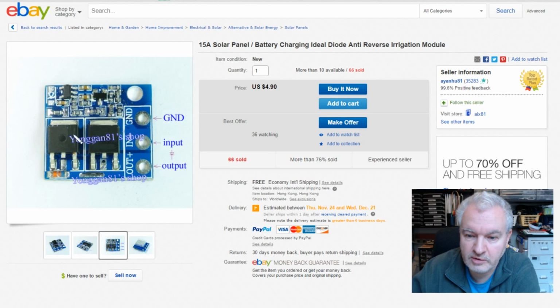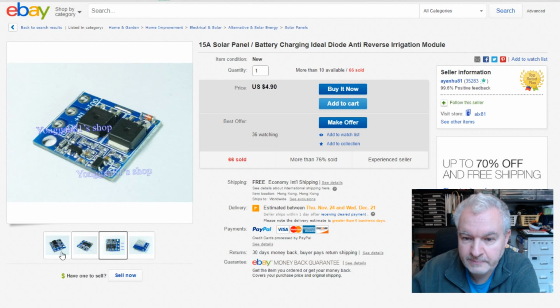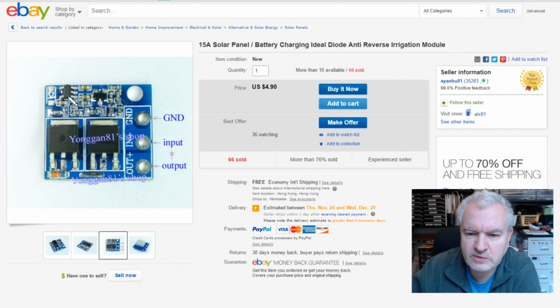There, again, you know, there are the 2 MOSFETs in parallel, presumably, to get that 15 amp rating. On the single MOSFET one, it was 8 amps. There's a little heatsink on the back. Can we see any more detail on how that circuitry works? But it looks like that SOT23 is some sort of controller. Now, does this one that I've bought have that on it. Is there something maybe hiding under those connectors? I think they're going to have to come off, you know.